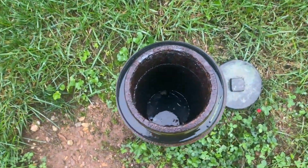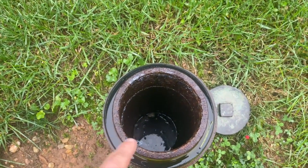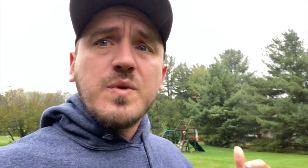We ran the water for about five minutes and we saw that it backed up — that's not good. The water level should never be inside of this clean out because that usually means something's going on. When we listen to the dry well we can hear that the water is not flowing as efficiently as it should be. This tells me we have a partial clog in the outlet line or a potential partial collapse. Based on the age of the home I expect to see cast iron piping. Cast iron piping as it ages starts to do what's called pitting — essentially rust — and as the pipe continues to pit it grabs debris and slowly shrinks on itself until it gets clogged up. Super common issue with a system like this.